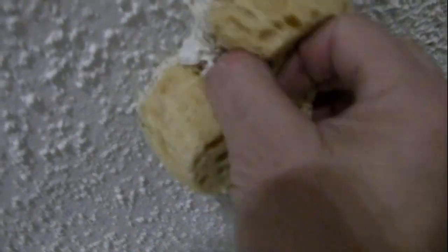You can see that's a little thicker there - it's coming up a little heavy. The texturing material is a little thicker right here compared to over here. You can also load up your sponge ahead of time, just smear some on there where you start, because otherwise it may suck off too much material. You can wipe some away and come back, or you can take your putty knife and scrape some of that away if the texture is a little too heavy. It's real simple - just slapping it on there.